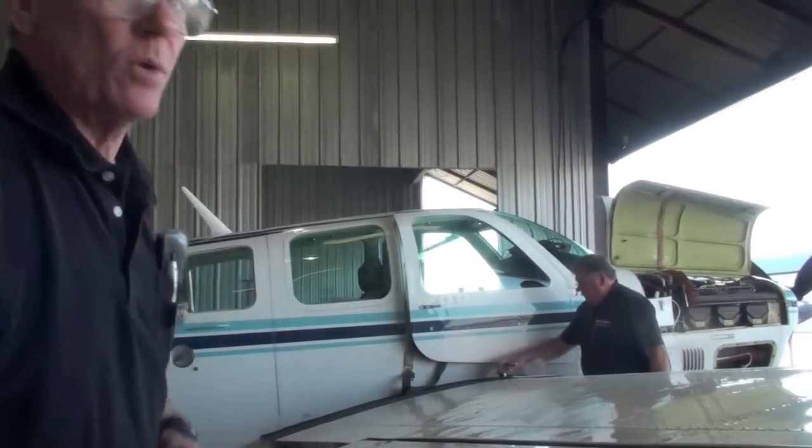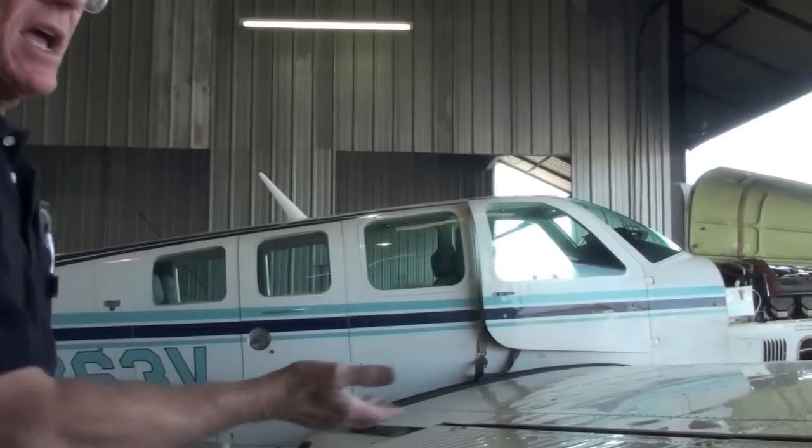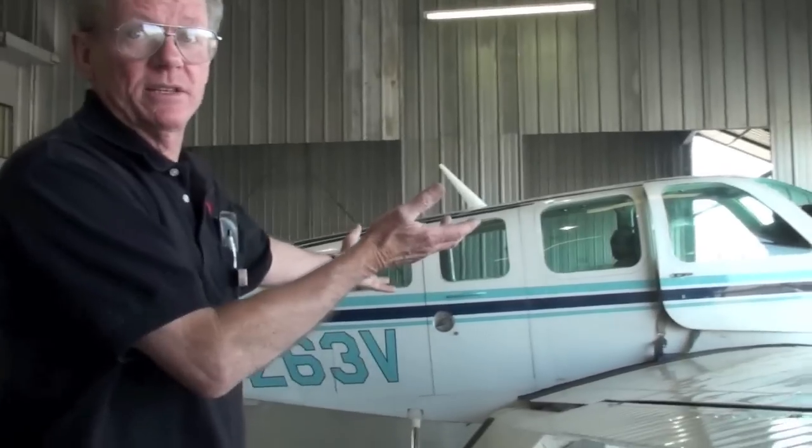I want you to go out and do the check we did at the very beginning with the flaps up, center the wheel, and if everything doesn't line up, you know the aileron's not attached right. Because we know now that it all lines up, don't we? Right.